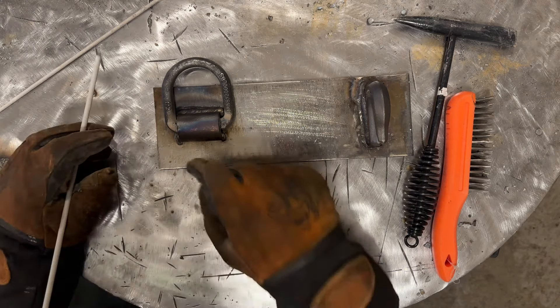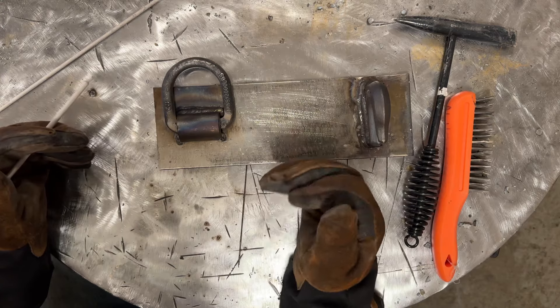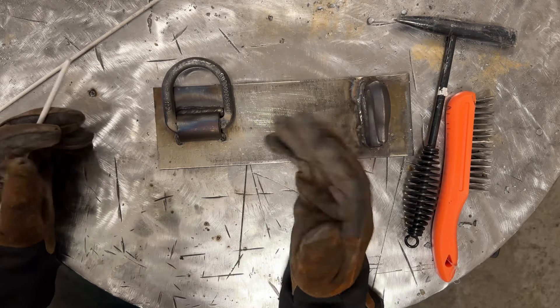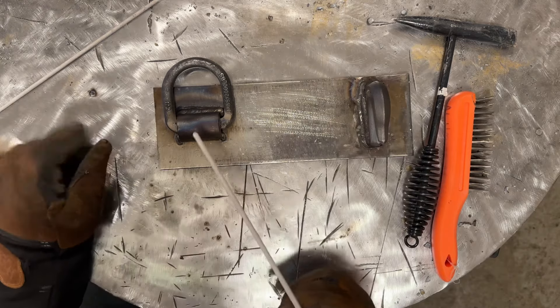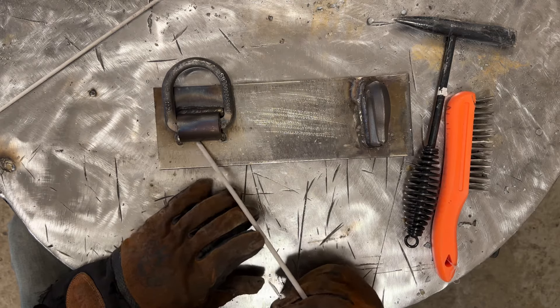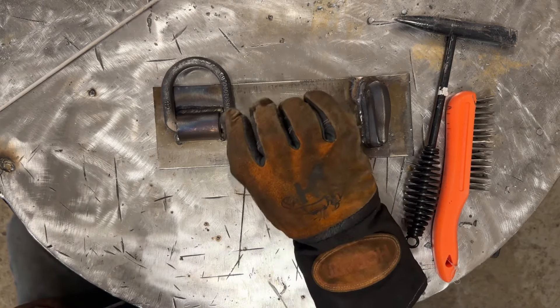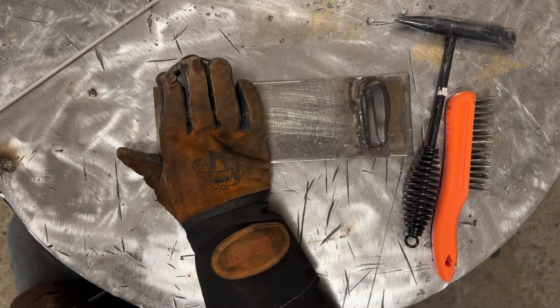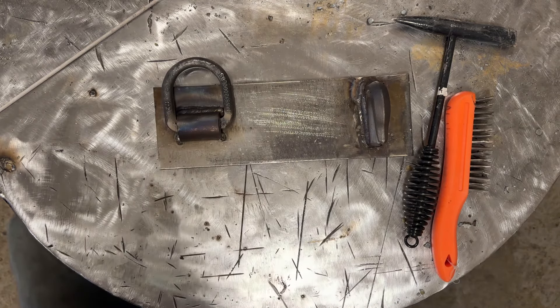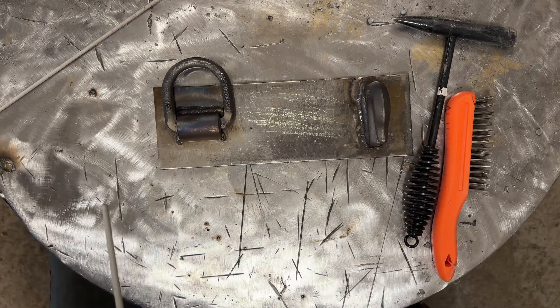That's the kind of pressure you want - slowly melting the rod. If you jam it in too hard it'll quench the hot metal and stop melting. This becomes very important with smaller rods filling a gap. If you don't put that pressure and feed it in while moving slowly, the weld won't fill up and will stick to only one piece. You saw that earlier where the weld only deposited on the plate and not the hook. There is a limit - you can't bridge a half-inch gap in one pass - but you get the idea. Still a little hot, but let's go.